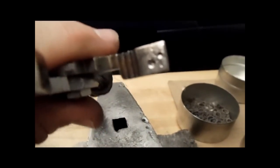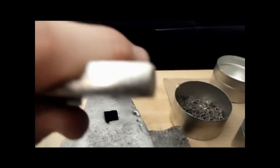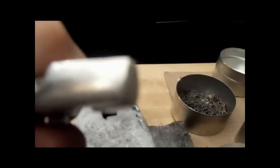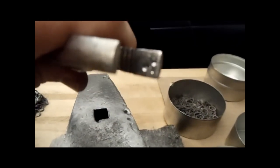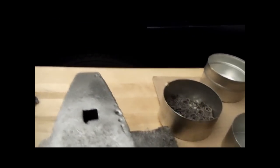Here we are, that's what it looks like, backside, rivet's poking through. Here's where these pliers come in. So, the best way that I do it is put it over that deep pocket, squeeze as hard as you can, move it over the shallow pocket, squeeze again, and then from here it's pretty much riveted, but again, I just move it back to a flat part with no pocket, lightly squeeze it, then back to the shallow pocket, squeeze it, and the last one. There we go.